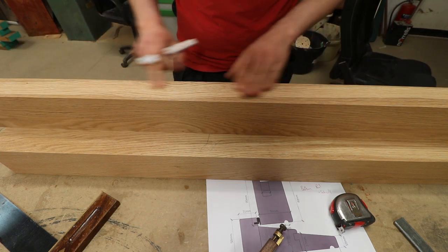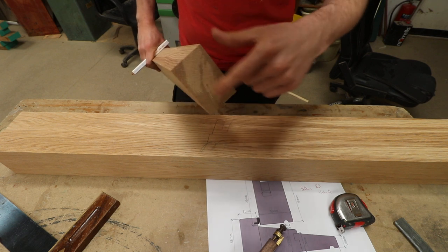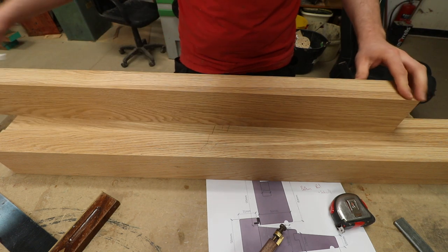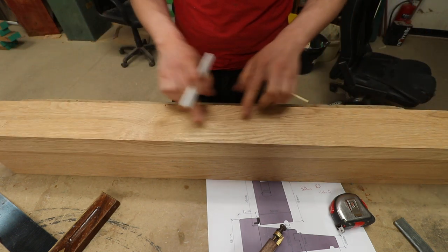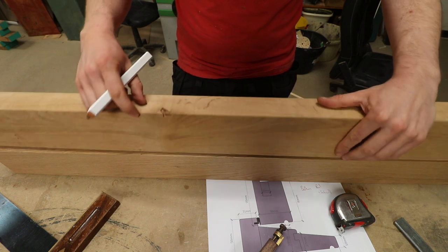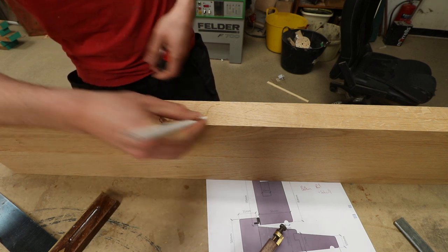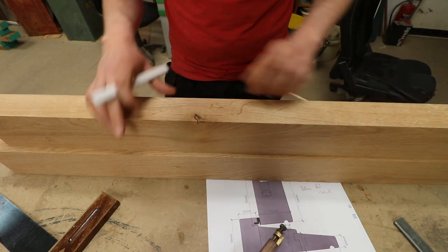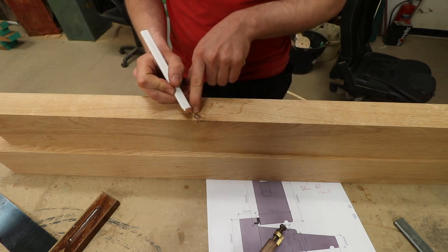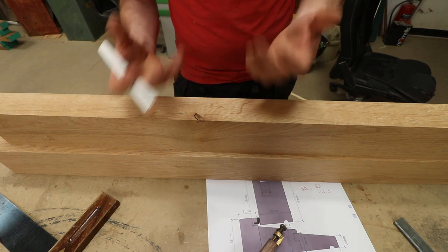Look at this final bit. That's quite nice. I mean, there's a bit of a difference in the grain here. You see it's got like a bit of a white patch in the centre and darker at the edges. Probably tempted to not see that so much. So pretty good along all of this edge, so that's lending itself more to an inside and that more to an outside. Have a look at this knot here, see if it will go with a rebate. So rebate's going to come to there. That's risky to say that that will go in a rebate because it looks like the knot is disappearing in a diagonal, so you're going to see that if you rebate. Still have a knot problem there. Not the end of the world because it's not a bad knot, but we'll perhaps hide that against the plasterwork in a second.